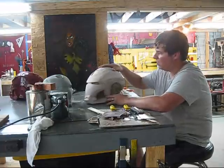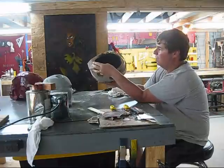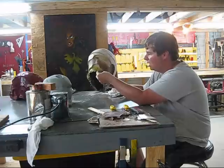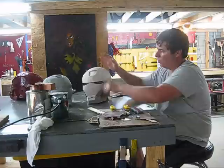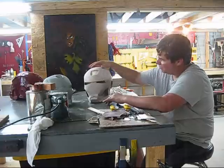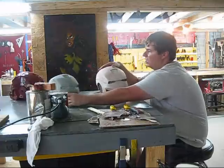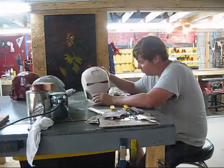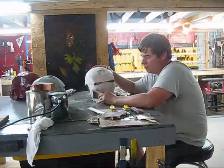Now, onto this one. This is actually a product — I put some gel coat in that mold and then fiberglassed it, which was painfully difficult. I got real itchy. I should have ordered some casting resin. Anyway, we did end up with a workable casting. You'll notice I have a lot of Bondo on here that's been shaved down and shaped. I'm trying to get a very nice profile on it because as you can see it's bigger than its original — this is so I can put electronics in it and be comfortable. It still looks good scale-wise, so I'm trying to get a nice profile on here because when I finish this bad boy, it will go in the mold.